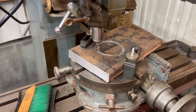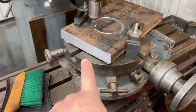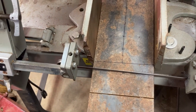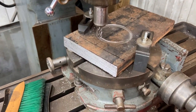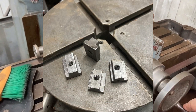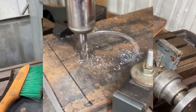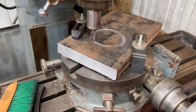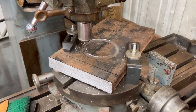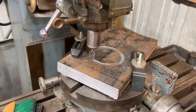Here's where the progress kind of ground to a halt. I got a piece of one-inch plate, one by six, about a foot long. Clipped an end off on the band saw — which is why I've got a big band saw. Finally got my milling machine wired up with a VFD. I'm not an electrician. Made some progress doing some milling — set it up on the rotary table. We had to make some T-nuts for that, centered it, and started to mill a hole through the plate. Everything was great. Took a break for lunch, came back, and it's dead — VFD won't run it. It's probably got something to do with me. I'm real good at cutting stone; I'm not a good electrician. It was working on factory default settings and seemed fine, and then it quit.